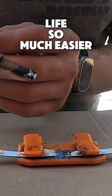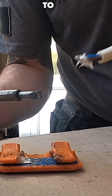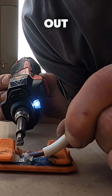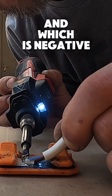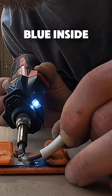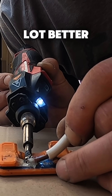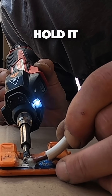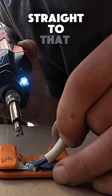I'm going to attempt to solder the cable to the actual LED tape. Looking at it, you'll find there's a little indicator showing which is positive and which is negative. Getting the right way around, you connect them up brown to brown, blue to blue, inside the wago box I'm putting on top of the cupboard. All you want to do here is put plenty of flux on it, get it nice and hot, and hold it on there.